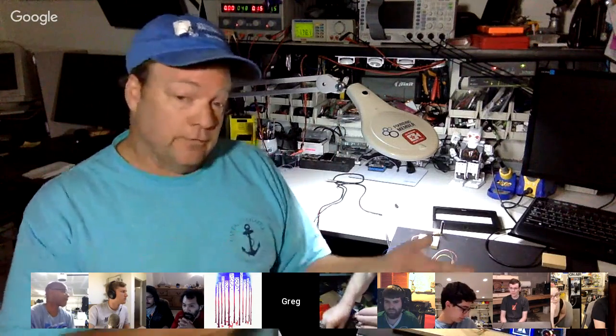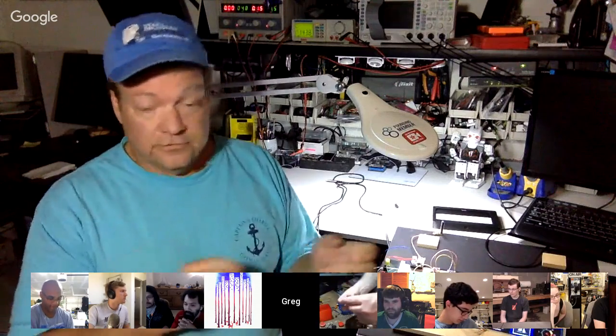So I've got configuration screens for the SMS and for the Wi-Fi, and little emulated analog displays for the refrigerator and such. And eventually what I hope to do is pull in the other data that's already on the boat. Boats have a proprietary bus, CAN bus, which is something the ESP32 actually has a CAN controller built in, yay. I'm hoping to decode that and maybe make a library for other boaters that might want to make stuff. It's just a serial bus and has a whole bunch of messages.